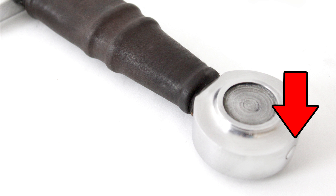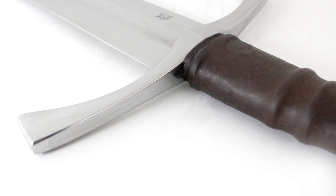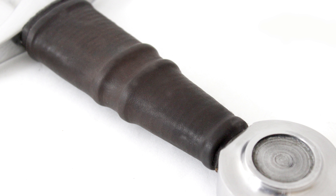The tang is peened over the pommel at the end. The sword has a Style 6 guard, which was popular in the late 13th and through the 14th century, so it's perfect for the sword and historically accurate. It's flat on both the top and the bottom, thicker closer to the center, and then tapers down as it comes to the edge. As you can see here, the guard flares out as it comes down to the quillons and forms these nice little claw-like shapes — a very nice design. The grip is four and a half inches long, made from wood, wrapped in very good leather, and then stitched. It has four large ridges — one at the bottom, one at the top, and two in the middle — with smaller ridges in between. This makes for an excellent grip, fits very nicely in the hand, and is held very solidly. It also adds quite nicely to the aesthetic of the sword.